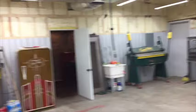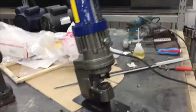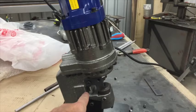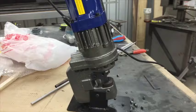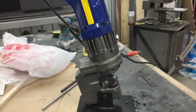I'm going to be making a hole punch station with this, using the foot pedal. The whole unit is going to be adjustable on some linear rails — there'll be a fence, and this part will be adjustable on linear rails so you can set the depth, meaning how far into the middle of the piece you're working on. There'll be a little tape measure and a clamp to adjust it back and forth, with the fence stationary and this part moving.